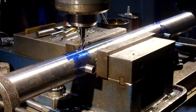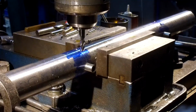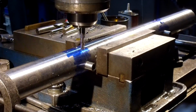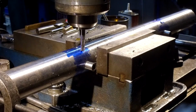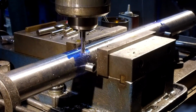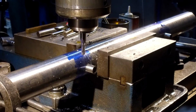Okay, all right, there we go. All right, let's lock it in. All right, we are zeroed there. We're going to lock our spindle so we can feed it. We're still on the high end. This is a carbide end mill, center cutting. And all we need to do is come down, and we're just looking for almost a round circle there.